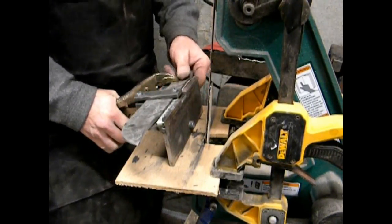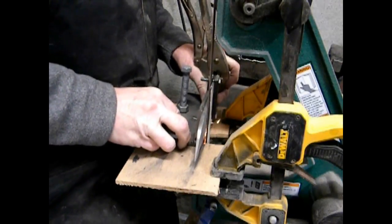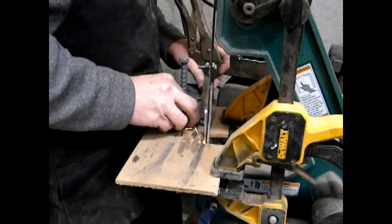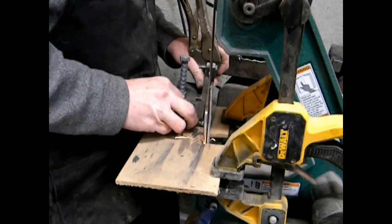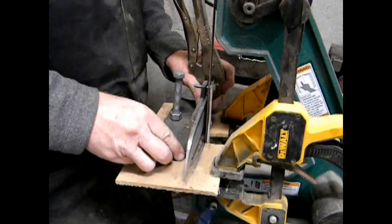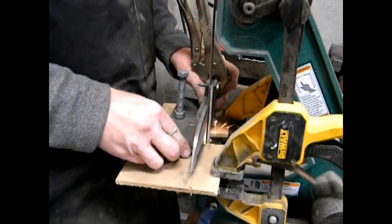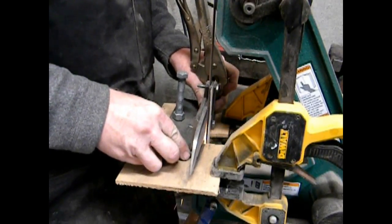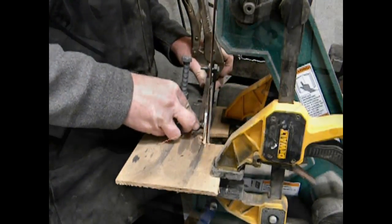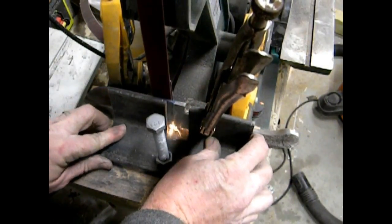I can adjust the angle on this bevel jig just with a bolt that's threaded through the bottom of the angle iron. So I started the grinding process. This particular knife is larger and thicker than anything I've done before. I wanted to leave the spine relatively thick — a little bit more than a quarter inch — so that I'd have room for the spine etching, for the stars I wanted to etch onto the spine. But that means there's a lot of grinding to do, a lot of material to remove. The one inch sander I have is not very powerful and was making progress very, very slowly on this particular knife.